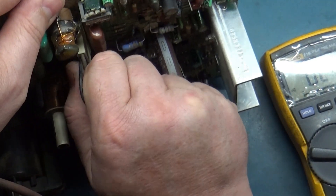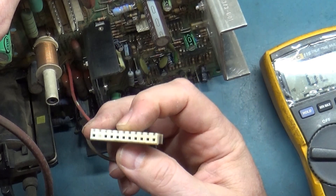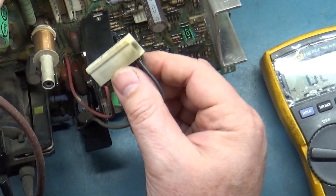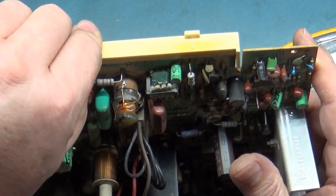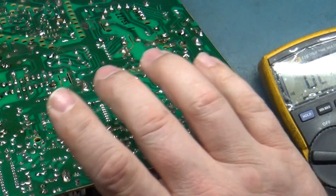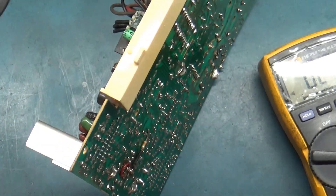Let's reseat this connector just to make sure — it's not really that burned up either. Let's put it back on 25 kHz for now, and put this back on before we forget. All right, let's get this sweep mod reinstalled and fixed up, and then we'll test this and see what we get. I'm going to have to fix some of the neckboard before we try, but I guess it doesn't matter if we are missing colors or not.